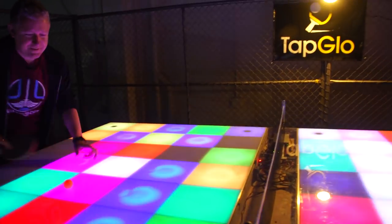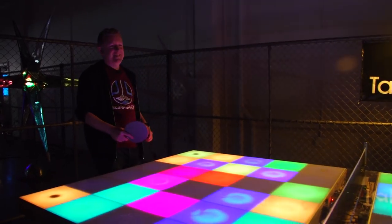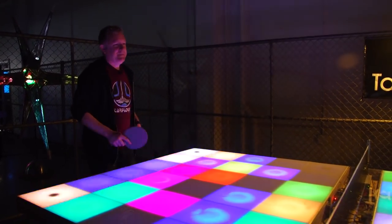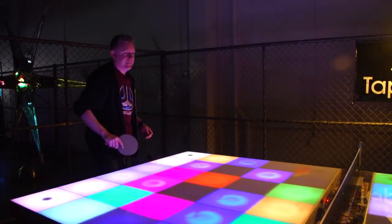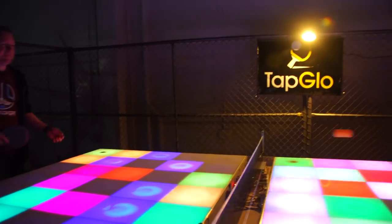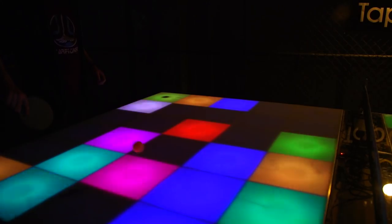Yeah, there are LED rings between each square — 28 with 12 LEDs each, so they're full color. And there are four piezo sensors on each side. It uses time difference of arrival, so it's all based on the sound of the ping pong ball hitting the table. The sound wave gets to the first sensor, it starts a timer, times how long it takes to get to the next three, and then triangulates where that hit came from.